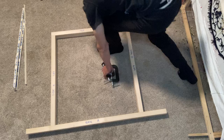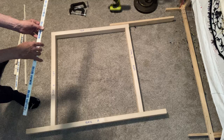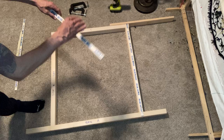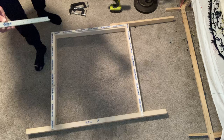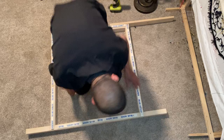Now we're going to quickly attach the carpet tacks. Look on the back — you'll notice they're labeled with which side they go on. This is D, and your sharps always point out from the frame, the sharp pieces always pointing away. The side pieces go all the way up to the base and the top. Side B, arrows pointing — sharps pointing out from the frame — and this also goes on the top and the bottom. Top C, sharp point pointing out away from the frame. The base is two pieces, sharp pieces pointing down, away from the frame. You can cover up all the writing on the frame with these pieces, then just drive all the nails in.